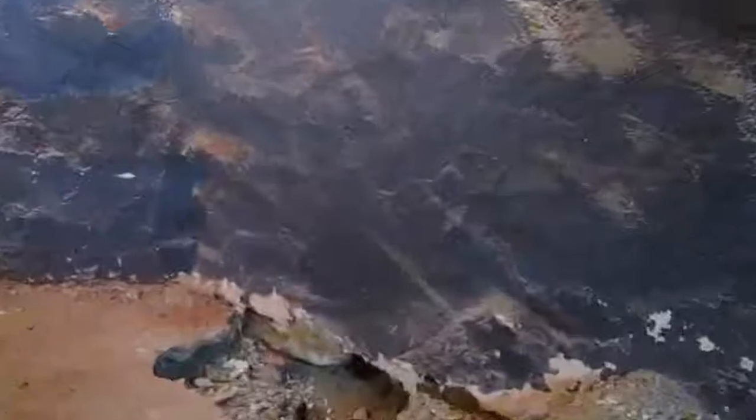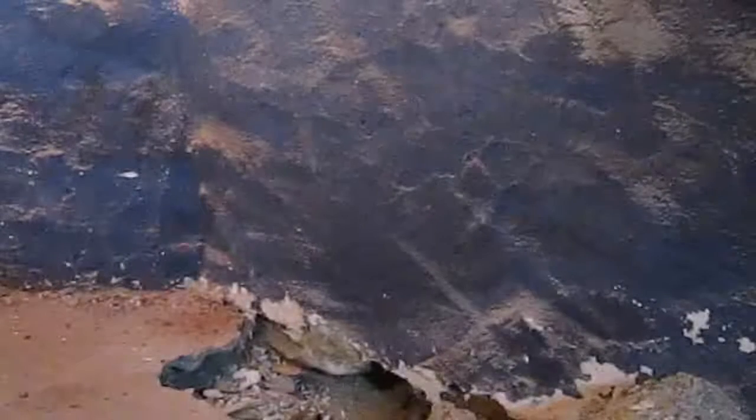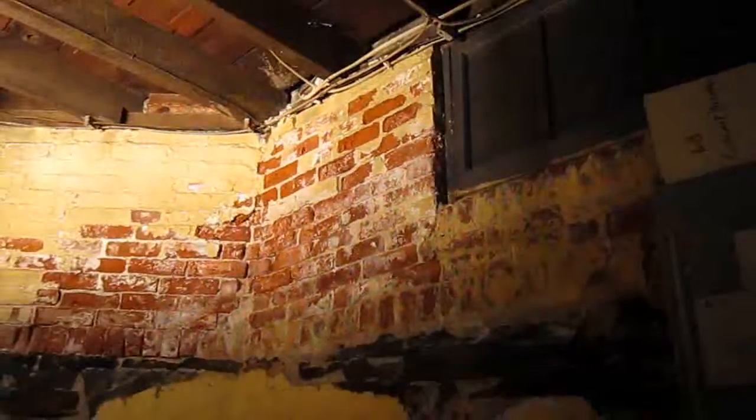So we see here, if you zoom in there, you can see there's a little hole that we've dug there, a little test hole to see what the condition of the floor slab was like. The slab is only like 2.5 inches thick, where traditionally it would be at least 4 inches thick with insulation underneath it. You can see close to the center of the camera there's a stone there. That's a piece of slate. That's the bottom of the foundation, and that's basically sitting on the sand, and all the other behind the plaster there, as you can see up here, is the slate there. So we have the probably 4 foot of slate as the main foundation wall, which is holding back the pressure from the exterior grade. And then we transition over to brick, which is probably about another 4 foot up there. And then I want to show you how our wood sill sits on top. So let's go and have a look.